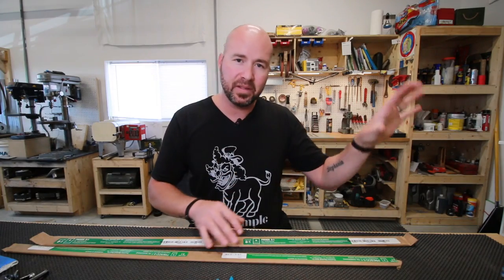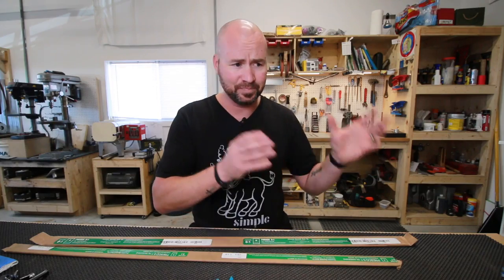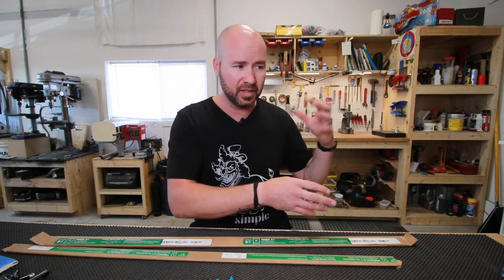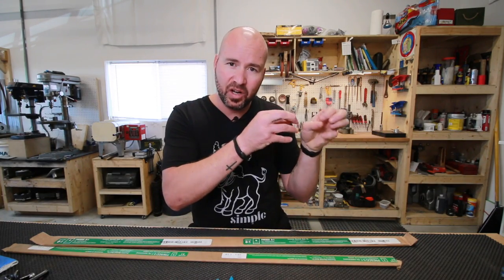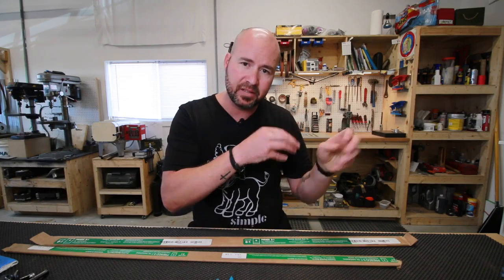So typically with these high carbon steels, you can do that with some type of a liquid quench. Some do better with water, salt brine, oil. Different types of oil work differently for different steels, but that's the basic generalization of how to get a martensite state of a knife. We've heated up our blade, we've gotten all the good stuff out of it, and then we've locked it in place. Now, once we're at that point, it's obviously brittle. It's like glass, right? Glass is super sharp, but it's very brittle. And the tempering process is where we controllably remove some of that martensite state out of the steel.